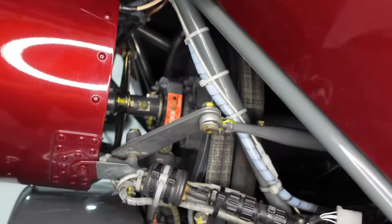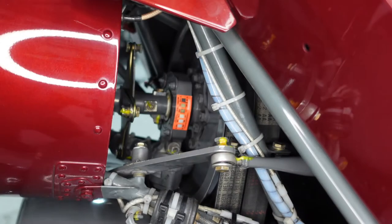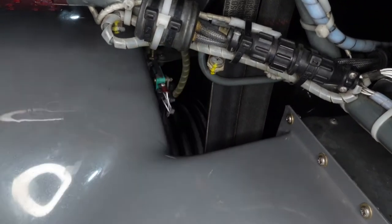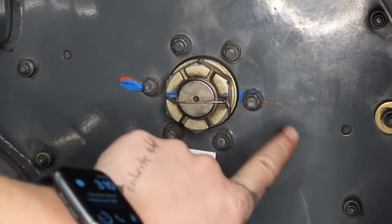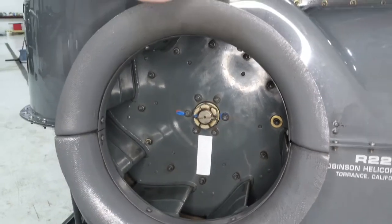Then the upper bearing and upper bearing teletemp — the teletemp is that sticker which tells if things got too hot. If they're all blacked out, that's a problem. I'm making sure there are no obvious signs of grease or problems. When you're doing the pre-flight, get intimate with the helicopter — touch everything. Here's the upper sheave; I stick my fingers in there and really feel it out. Plan on getting yourself dirty during the pre-flight. If you're clean after, you're not doing it right — it's supposed to be a physical inspection. Then the cooling fan nut: the torque stripe should be aligned with that wire that runs across. If they're misaligned, that's a problem — it's actually a great way to tell if there's been an overspeed. Run your hand over everything, making sure all the bolts are there.